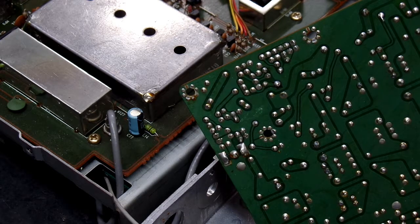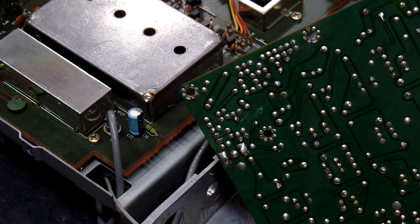And most likely transmit as well. The fellow who gave it to me was suggesting maybe it was the antenna relay or maybe the connector itself. I looked at both those issues and sure enough when I removed the board from its base I was able to identify the cold solder joint. I'll put it back together and I have a high level of confidence that will fix the issue.